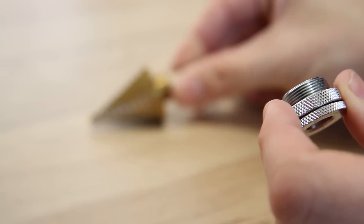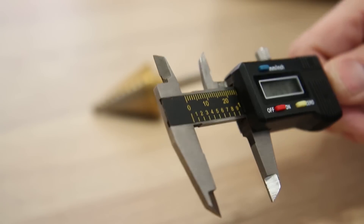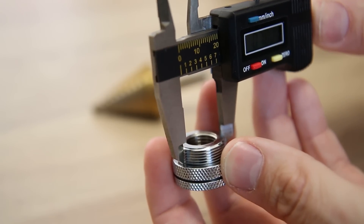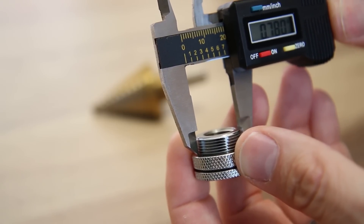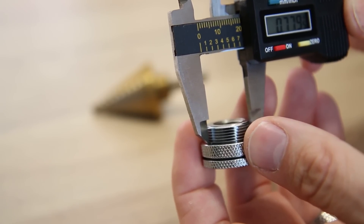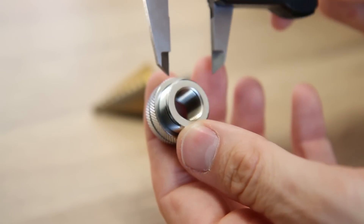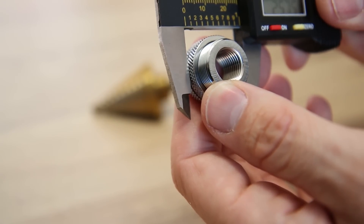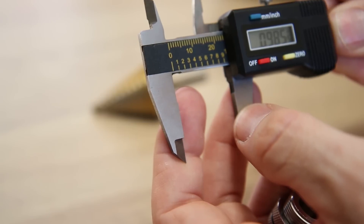There's a three-quarter-inch step on the bit which is perfect. If we take my caliper tool — you can get this at Harbor Freight for around six to fourteen bucks, it's worth it — and measure the outer diameter of the threads, you can see it's about 0.779, so just slightly larger, around 0.78-ish. We're sitting at about three-quarters of an inch there, just over. For those who use millimeters, that's 19.8 millimeters. You have to keep in mind you don't want to drill the hole too big, otherwise the collar isn't going to hold it — it'll just fall through. The outer diameter of the collar is 25 millimeters, or 0.98 — just under one inch.